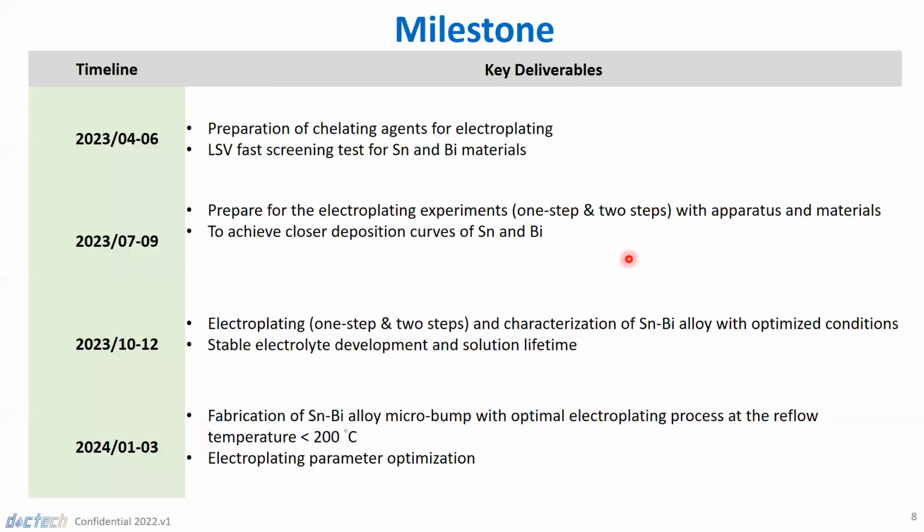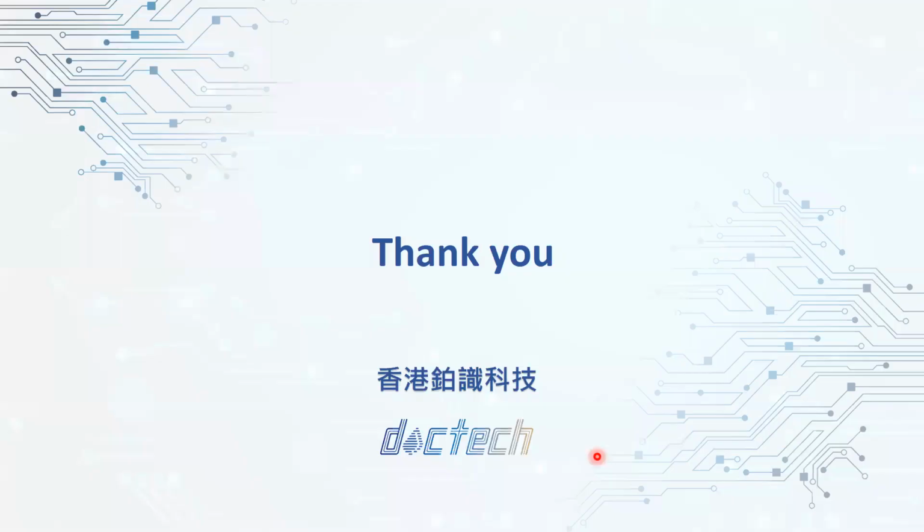Here is our initial milestone for the TISSP second year. In the first quarter, we will prepare the complexing agent after material fast screening of tin and bismuth. In the second quarter, we conduct electroplating by a one- or two-step method to achieve co-deposition of the alloy. In the third quarter, under our optimized condition, we can prepare a stable electrolyte solution. For the final product, we aim to achieve a temperature of less than 200 degrees for pillar-based soldering microbumps and deliver the parameter optimization of electroplating. Thank you.